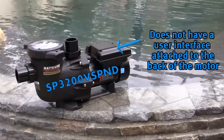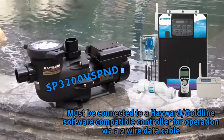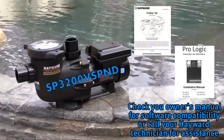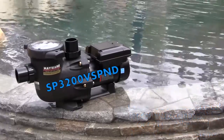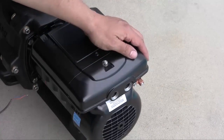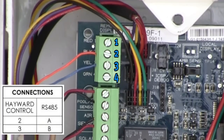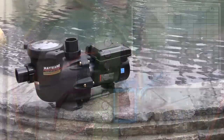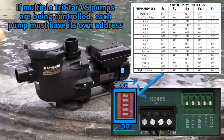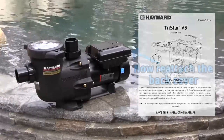The TriStar VS SP3200VSP-ND model does not have a user interface and must be connected via a 2-wire data cable to a Hayward Gold Line software compatible controller for operation. Check the owner's manual for software revision compatibility or call your Hayward technician for assistance. Connection wire must be rated for a minimum of 300 volts and may be up to 500 feet in length. Remove the cover from the back of the motor as done for electrical connections. The two wires are run from the RS-485 A and B connectors on the pump to terminals 2 and 3 respectively on the remote display connection on the Hayward Gold Line controller. DIP switch settings are needed to set the pump address for the controller. If multiple SP3200VSP-ND pumps are being controlled, each pump must have its own address. The pump address chart is available in the owner's manual. Now reattach the back cover.